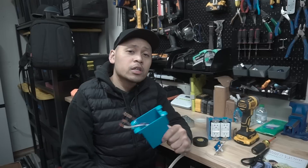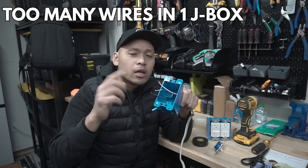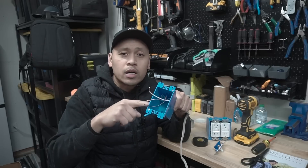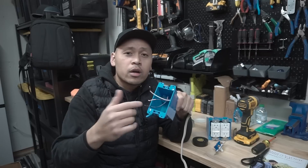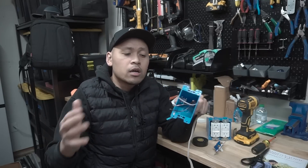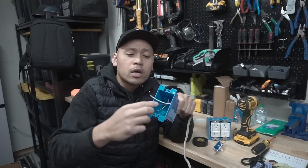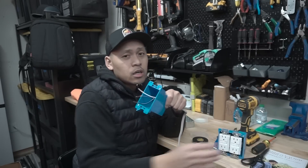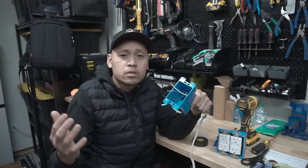Another reason relates to overcrowding: there are a lot of wires going on, and many people overstuff their J-box. They're unaware of how many wires are allowed per one-gang, two-gang, or three-gang J-box — I'll cover that topic in a future video. With overcrowding, you have all these wires connected to outlets and switches, and there's a possibility one of those wires could touch the terminals and cause a spark.